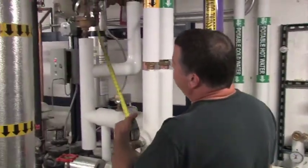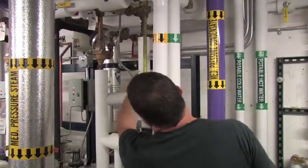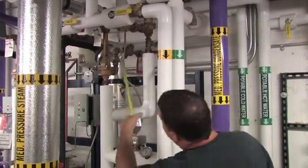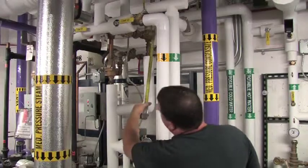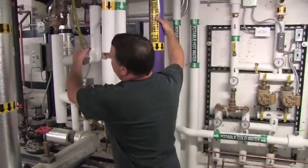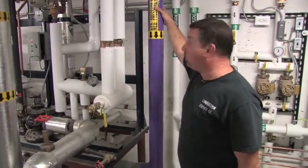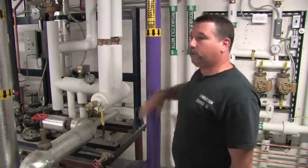So like I was saying, we have a primary and secondary mixing valve, which just blends the water to our desired outgoing temperature. We have a temperature gauge on the outlet located here, which gives us our actual outlet temperature. We have a safety device here, which is a solenoid valve, which is wired across two aquastats, sensing the outlet temperature of the first stage and outlet temperature of the second stage blending valves. If they go 15 degrees over the set point, then they will snap shut this fast-acting valve and eliminate any hot water from leaving the unit. So that is the safety device for high limit temperature on the unit. They're just a safety device. Under normal conditions, nothing electrically is happening with this unit. It's just running. It's just converting steam to water and running the water through the unit.